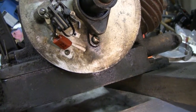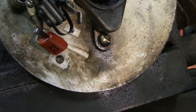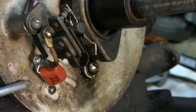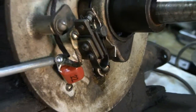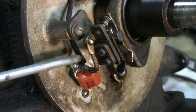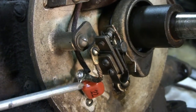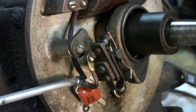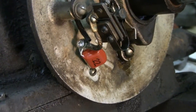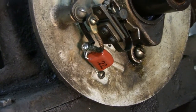Here's what it looks like without the tape on. You got one wire that comes out of the capacitor and goes to here - that's a ground. But then this other side here, I just put a nut and bolt in it. This wire comes from your coil and goes to your points, so that's positive, and that can't ground out. If that grounds out, your machine just doesn't work.